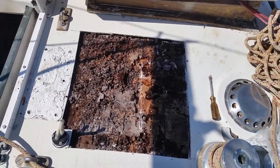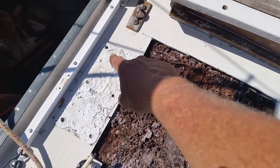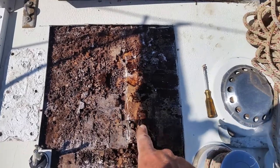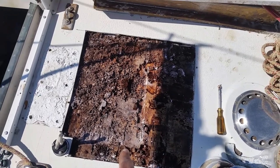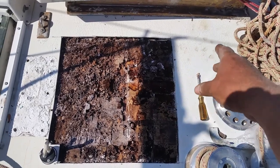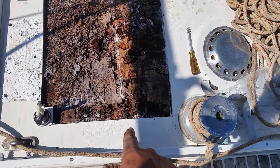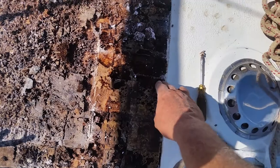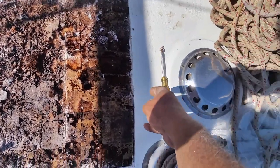Here is where I cut a big piece of fiberglass out of the decking. This area here is where the mizzenmast base normally goes, and as you can see we have got rotten core. I'm going to have to cut back even further because the rot is continuing out further than that. I started finding it solid through here and there, but there are soft spots in between.